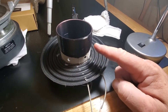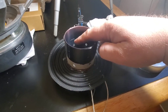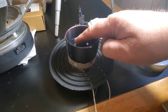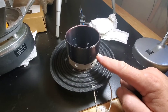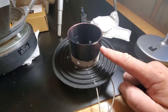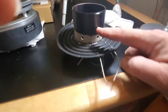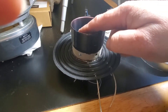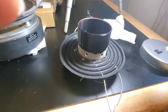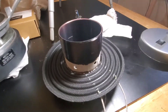I got the spider on the voice coil. If you're looking here, we got the mark for the top of the pole. It's easier for me to see this than marking to the top of the plate, so I did this one first, then did that one proportionate to the top of the pole piece so I could see it from down in the center. It's just a lot easier that way.